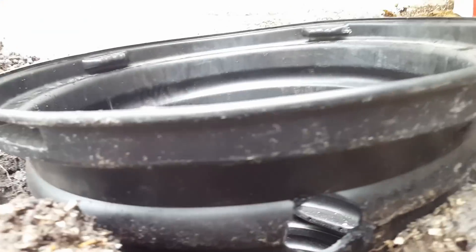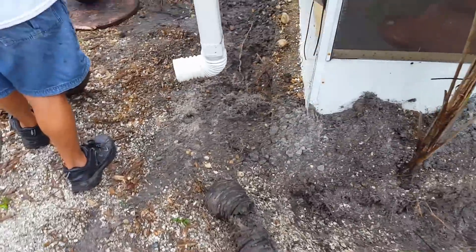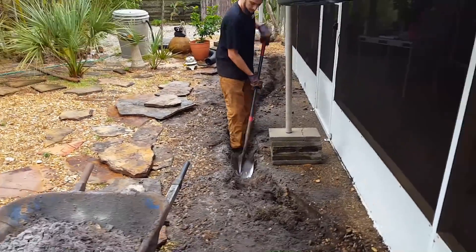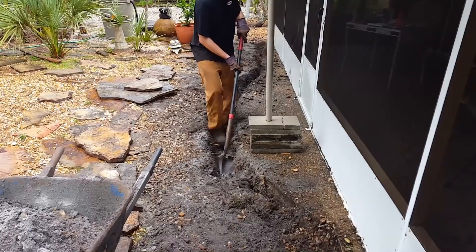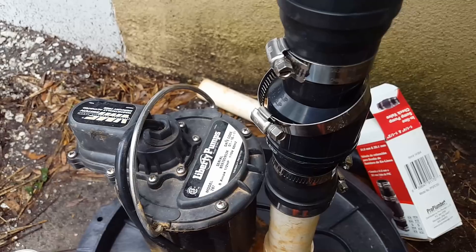We've got a nice two-inch hole for our inch-and-a-half pipe, which will come down this trench. These guys are still running barrels through here but we'll go around the side. You can see they're coming right along. There was an old perforated pipe here that really didn't go anywhere — it just went into the ground. Make sure that when you dig for the easy flow drain you're a shovel wide because it's eight inches wide with the peanuts, so it's got to be wide enough. It only has to be a shovel deep — we're not too concerned about fall or grade, it runs pretty much level.